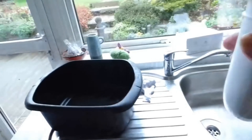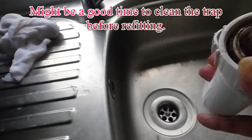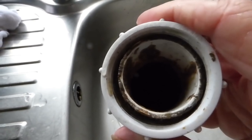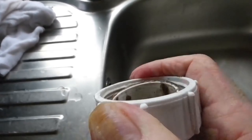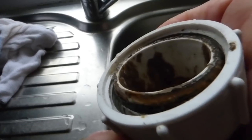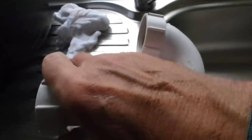Take the trap out, bring it to your washing up bowl and tip it out. Before you put it back, make sure the washer inside is okay — check it's not split or broken, otherwise it will leak. If it is broken, as a desperate measure you can wrap PTFE tape around it to make a kind of ball and wrap it around. Best to get a new washer though. Check the washer on the bottom end too.